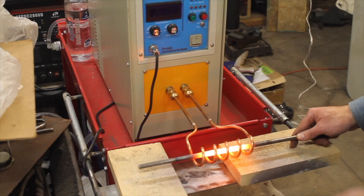Next time I make a long, loose coil like this, I plan to flatten the loops at either end — that is, not as steep an angle as the rest of the helix. That will concentrate a little more magnetic flux at the ends, and the heating there will compensate a bit for the loss of heat to the cold stock on either side of the heat zone.